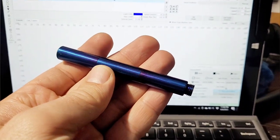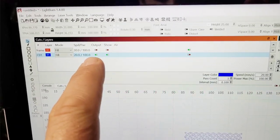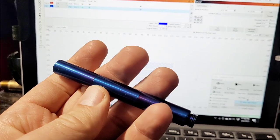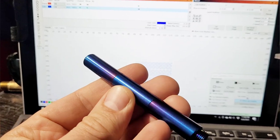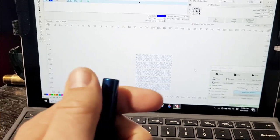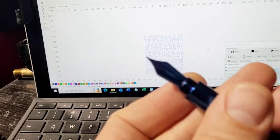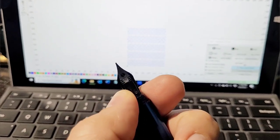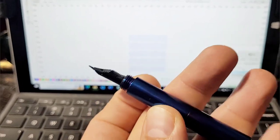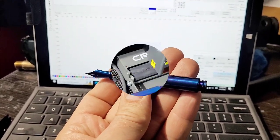When it comes to settings to engrave this pen, I have absolutely no idea, so I'm just going to give it full beam — 100%. So 22 watts, and we'll go at 20 millimeters per second. I'm hoping it will be tough enough to blast off this coating, and I am worried again about similar wavelengths. What I'm going to do now is take off the cap and remove the nib and the feed because those are plastic — well the nib's not, but the feed is ABS plastic. I don't know how much heat this will generate, so I don't want it to melt inside the pen. Wish me luck.